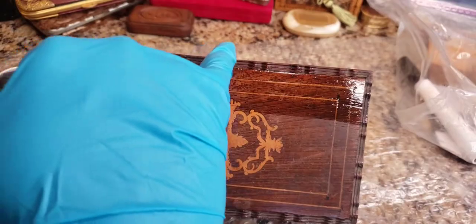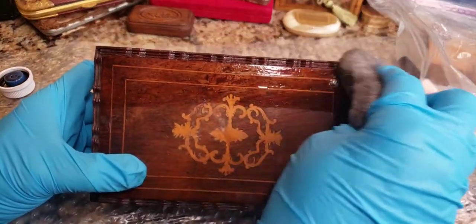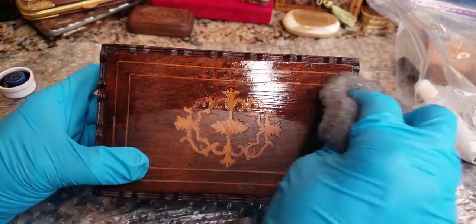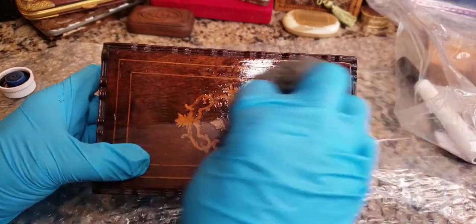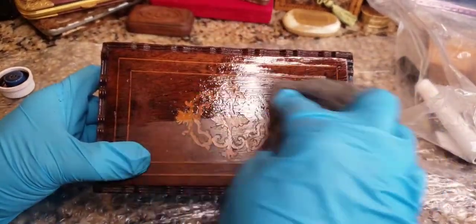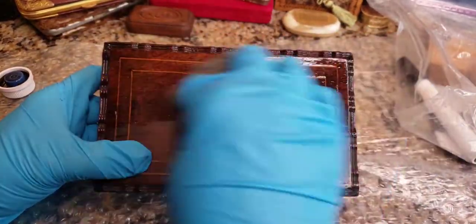And by the way, I've got to get into these nooks and crannies, and I'll show you the difference between one half and the other half. Now, it takes about 30 minutes for this to actually settle into the wood, and then you just get an old ripped up t-shirt or rag and wipe it up. This is going to give the beauty back to your wood, and some pigment and color, and hide some of the scratches and discolorations on it.